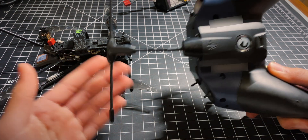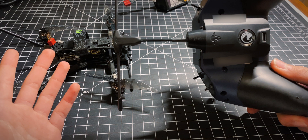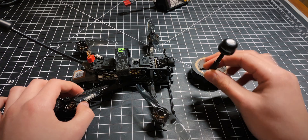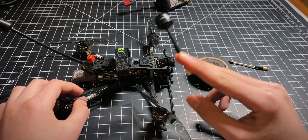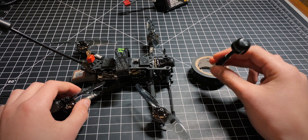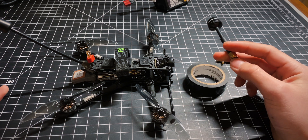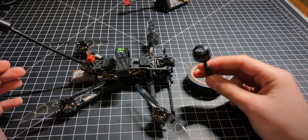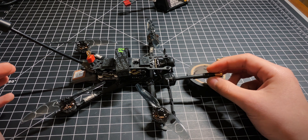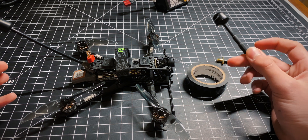Many of you are probably already running Crossfire, but Crossfire, R9, Ghost — a high-end radio system — is just going to go exponentially farther. Another tip on that note: invest in your antennas. Your antennas are not the most expensive part of your build, but they are the single biggest factor for how far you can get out. The TrueRC Singularity is the choice of most people who are going super long range. The AXE is also pretty good, but get a good antenna.